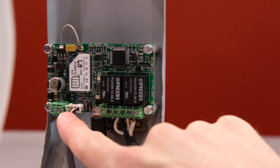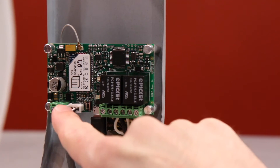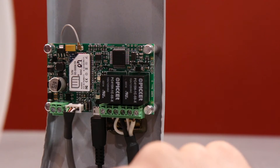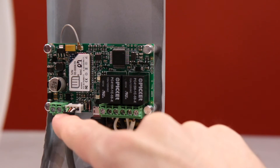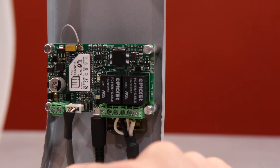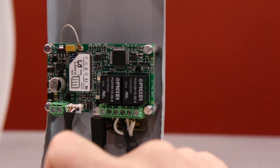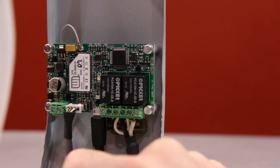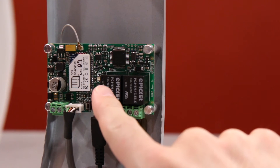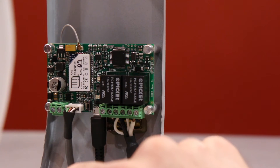Taking a closer look at the NERD, you can see the inputs are coming in right here. Input 1 is the photo transistor, and that's going to be the green and the brown wire. Input 2 is going to be our push button switch, which is the white and the black wire. We added the push button switch, or input 2, so we can turn our fan on and off manually without having to turn our bedroom light on or off to get it to work. We then wired the relays in parallel so that either input can control them.